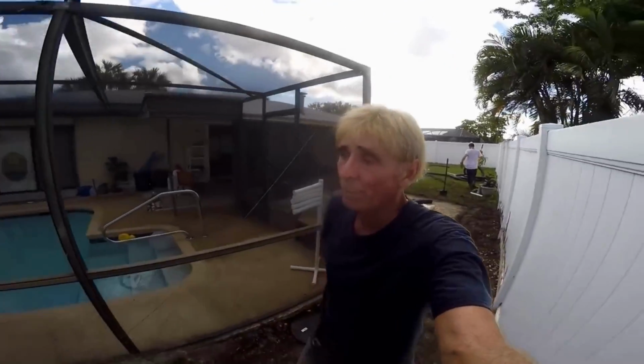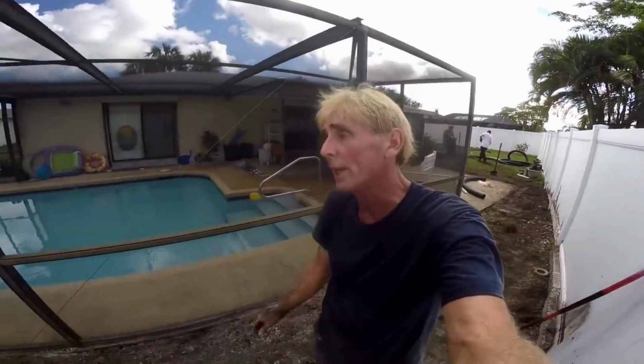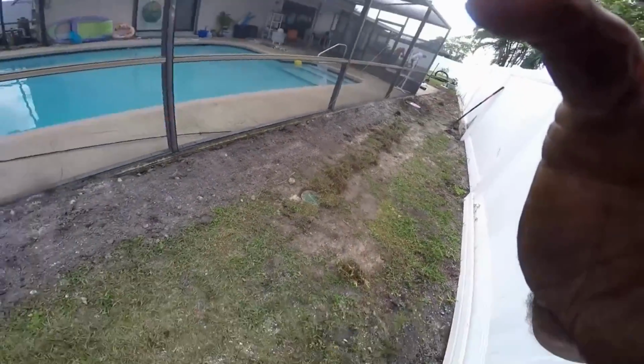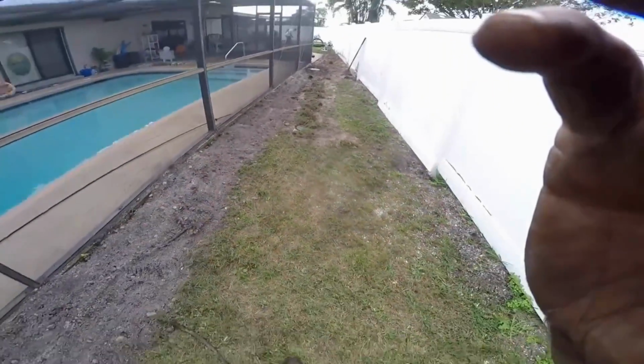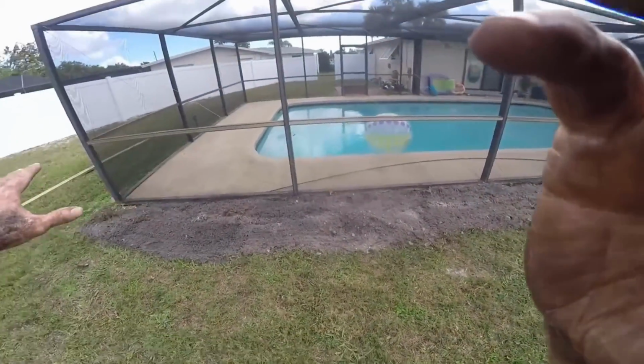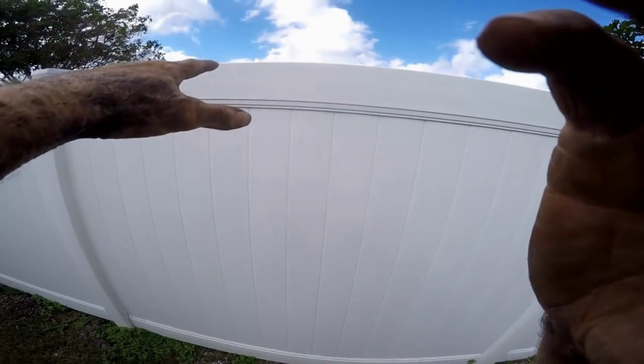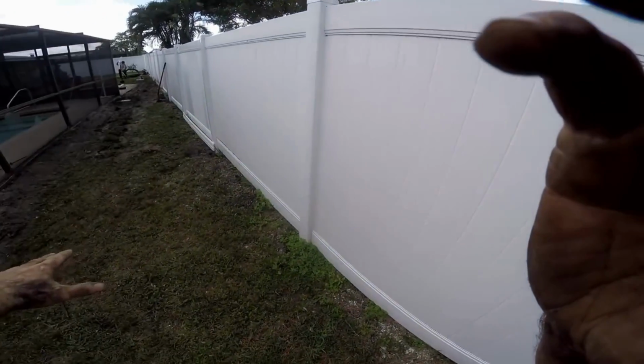Okay, so we're pretty much done. We've covered things up. Let's take a look. The line starts here at a small 6x6 catch basin. This picks up, let me step back, this picks up all this groundwater that comes down here from this section of the yard and around. It all travels down and around and comes through. It also picks up the neighbors' yards and their downspout drains because they're all pointing back this direction.